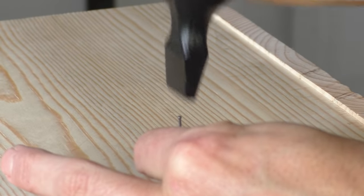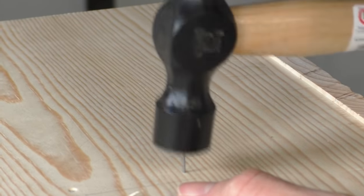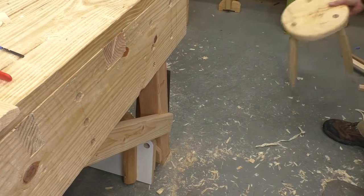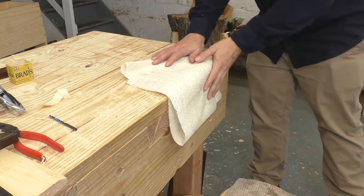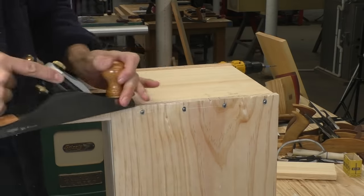You might notice that my rabbets are overhanging the sides a bit — that was on purpose. Leaving the rabbets extra long gives them more resistance to splitting when you drive those big cut nails. I picked up this trick from Joshua Klein's excellent book, Joint, which might be the best book I've ever read on hand-tool joinery. Klein gets it done with exactly zero screwing around and with the most basic tools — I get nothing when you buy this book, but I'm still going to link to it in the description. Trimming up those rabbets is a breeze — all you need is a milking stool, shelf liner, chest, and smoothing plane. It only takes a few minutes on each end and your rabbets end up perfectly flush.